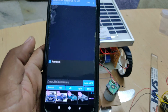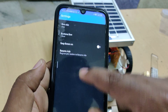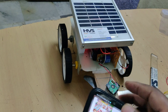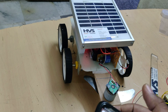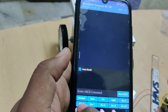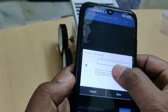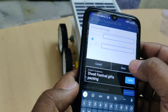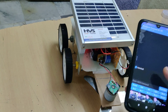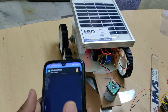We need one more button to turn the grass cutter on and off. Go to Options, then Settings, then Buttons Row — we need two rows. Now we can add two rows. Button seven: change to turn the motor on. Button eight: to turn the motor off. The characters used are small f, b, l, r, and s to control the robot and turn the grass cutter on and off.